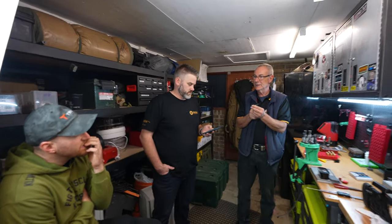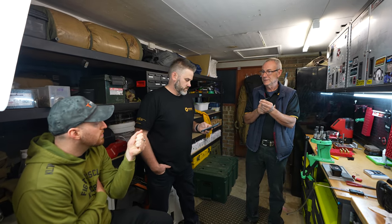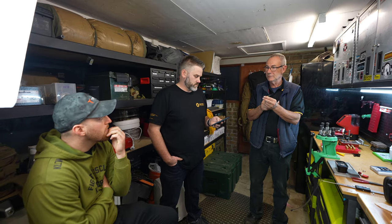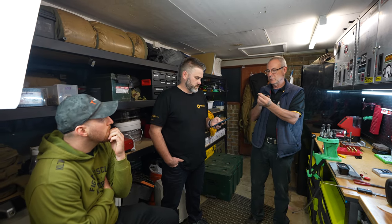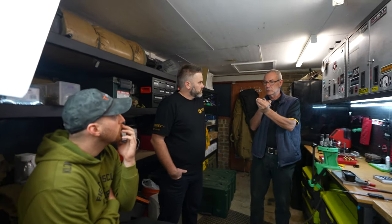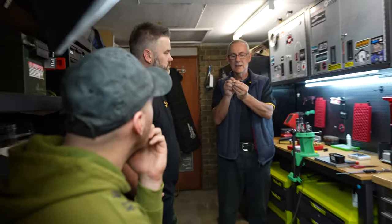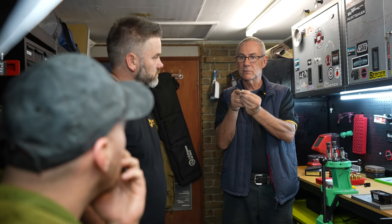Won't you get different readings on a completely sized case, like with the neck? No. Because it'll have more purchase. It'll change seating. No, it won't. The measurement from there to the engagement there is the critically important thing. You can have a different case neck length. You can have different dimensions in here. That dimension to that dimension there is the critically important one.